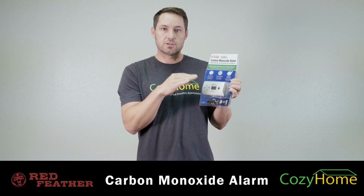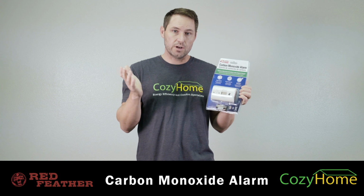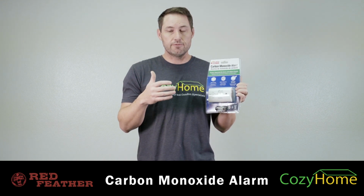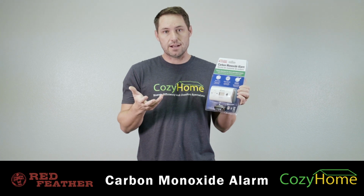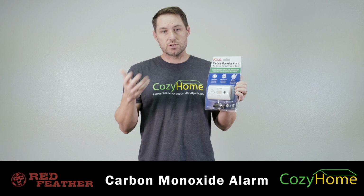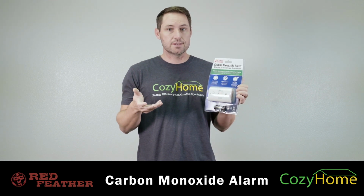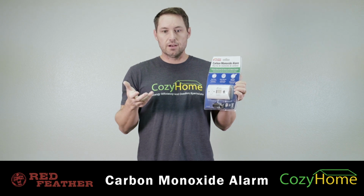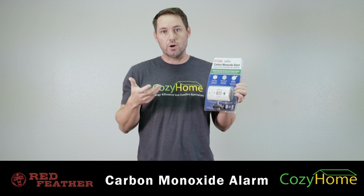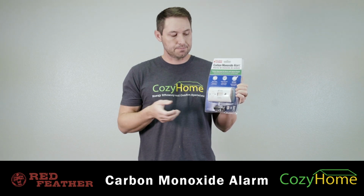When it gets to a certain concentration, the alarm will go off. If that happens, you want to make sure that you open windows and doors in your house, try to air your house out, and figure out what appliance is setting that off. So if you have a wood stove going at the time, maybe let your wood stove stop running for a few minutes. Or if maybe your oven is going and you're cooking something, you want to pinpoint what's causing that and then make sure you're not using that appliance until it gets serviced.